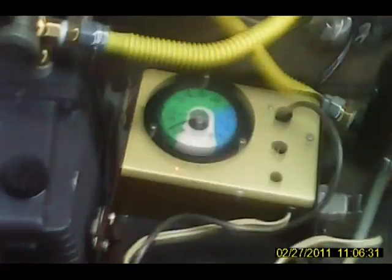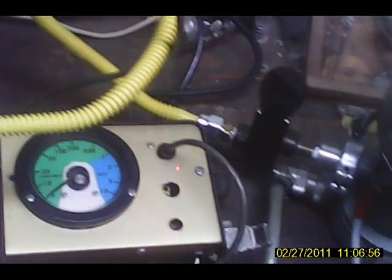We've been pumping for about three quarters of an hour. We're on the 10⁻⁶ scale and reading about 3.5, so it's about 3.5×10⁻⁶ Torr — that's pretty good. The body of the pump is barely warm to the touch; the controller itself has no heat at all. The roughing pump is warm, of course. Now I'm going to increase the back pressure and see how much backing pressure we can apply before the pump starts to lose pressure.